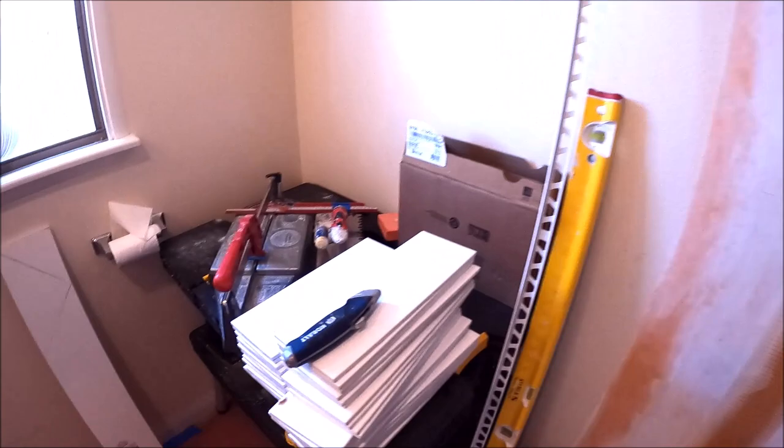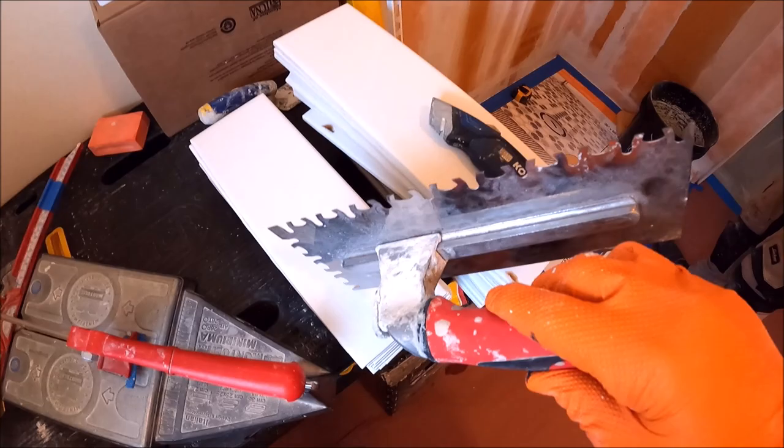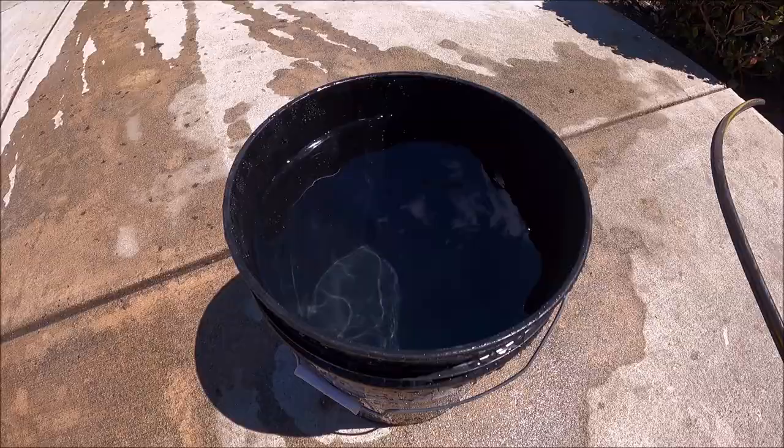We've got the Montolit Mini all set up in this small corner here. We're starting with holes and halves on the side. Everything is gonna be symmetrical. Again, full tiles, no notched tiles. And we're gonna use this Euro trowel. Does a good job with these 4x12s. Soak these in water, no need to back butter. Sticky, all set, time to have some fun.